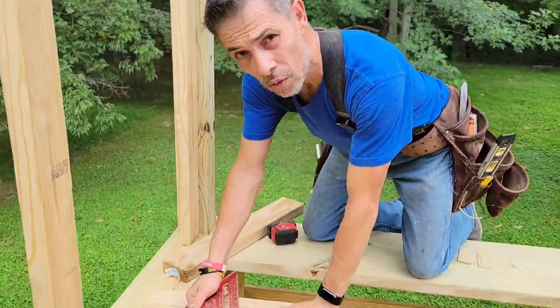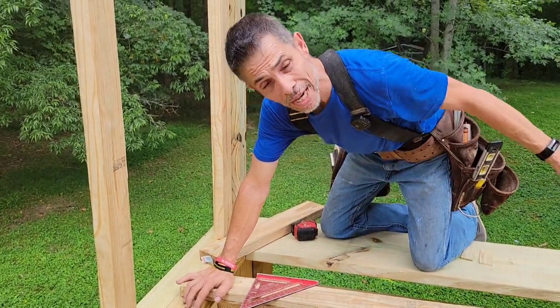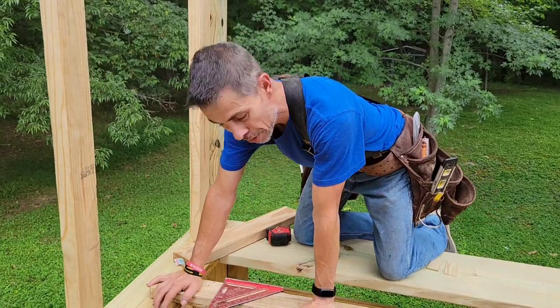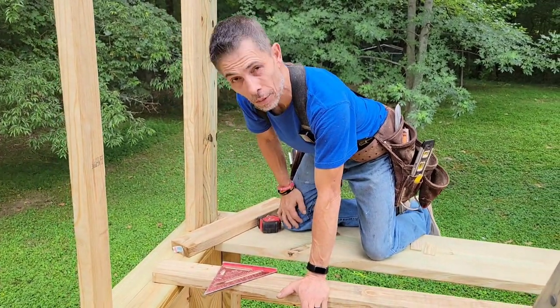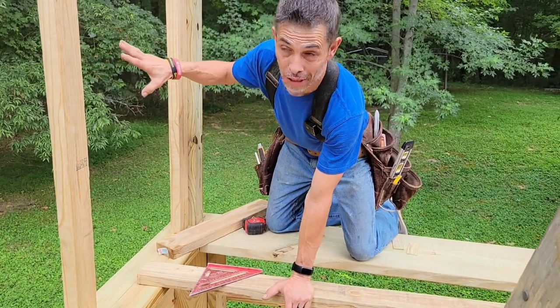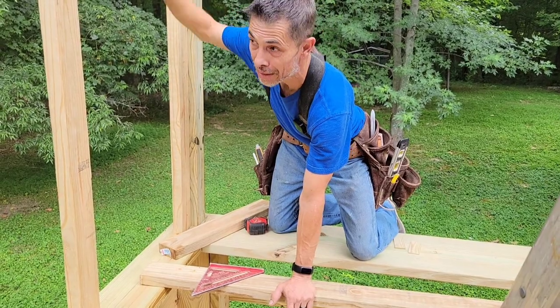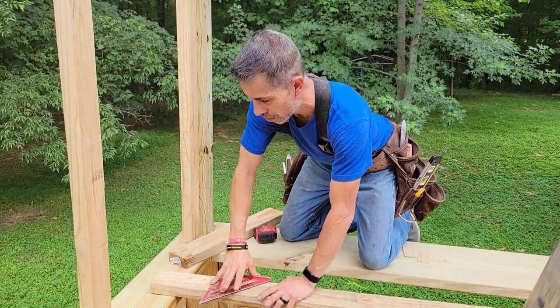All right, so now we are going to change what we were doing with our rafters. The customer wanted these to hang way out, and I tried to give it like a 6-inch overhang, but Kellie's saying we needed more out front, so I moved that in, and we're going to have around a 3-inch overhang. The reason I think that's okay is because nobody's going to be hanging out over on the other side of this unless they need to use the bathroom at the party and they just hit down the steps, but we don't need to start that as a habit.